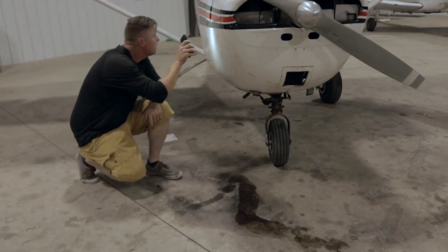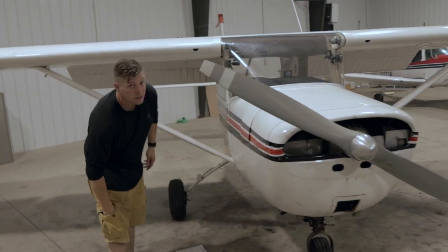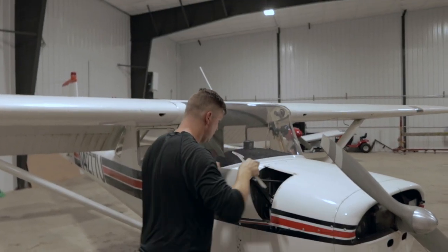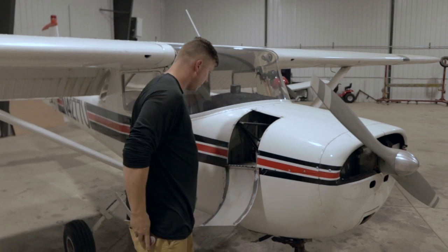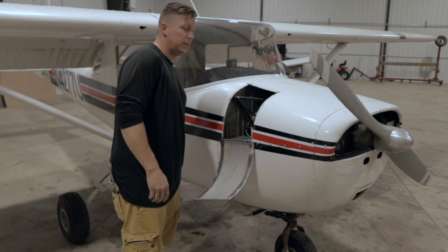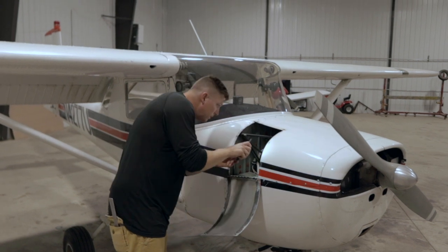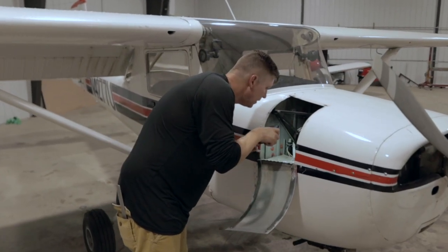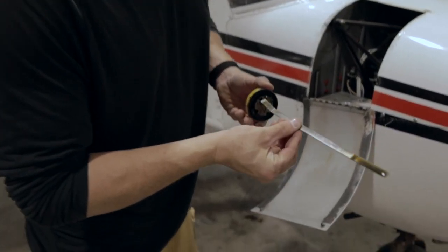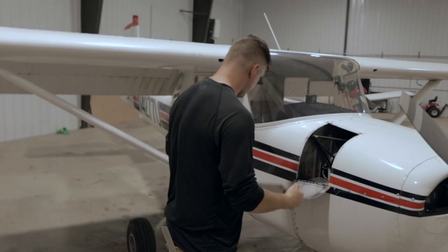Exhaust is good, and we'll just check the other side here real quick. Let's check the oil. I'll grab my phone and use my light to visually inspect and see if there's anything out of the ordinary, see if anything's leaking — everything looks good, everything looks tight. A little over four quarts. I think we should be good there. Close it back up.